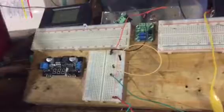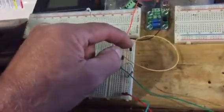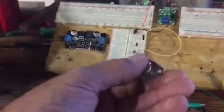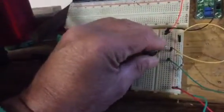Now, just realize that that thing is burning hot. So you would think that the resistor I have in here and the resistance in that wire, well, the resistance of that wire don't matter here, but you would think this resistor would keep it from overheating the 2N3055. Let's try another one. I think this one will heat it up, and I don't think it works anymore, but let's check it out.